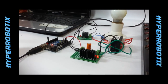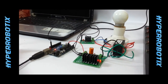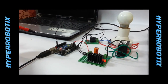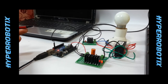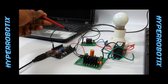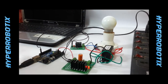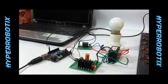The way this project functions is we send a 'light on' message to turn this 250 volt bulb on, and we send 'light off' to turn the bulb off. When we send the 'light on' message, it is read by Arduino, processed, and it turns pin 13 high — that is, 5 volts on pin 13. Pin 13 is connected to the relay port, and when pin 13 turns high, the relay closes the switch which drives the bulb to light up.